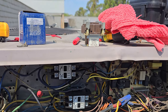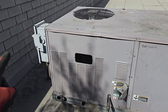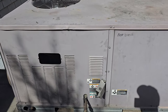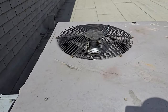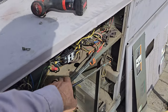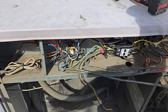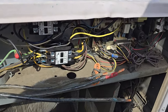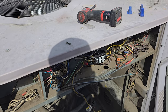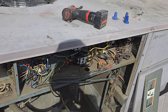I've got one more AC to look at and then more calls after this. We're back — we're going to change this disconnect switch. The AC has been working ever since I got it running, so all's been well. We're going to power it down and see if we can't get this thing replaced. We are going to eliminate all this baloney — the wire nuts and stuff. We're going to go directly from the disconnect right into the contactors since I redid that indoor blower motor relay. It shouldn't be too difficult to just tear everything down, get power shut off, and then start wiring everything back in.